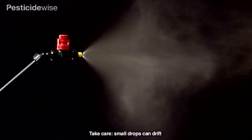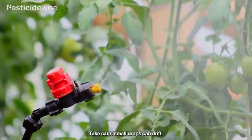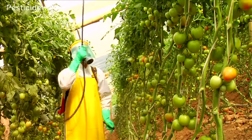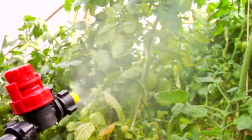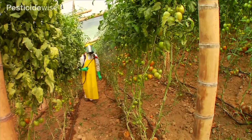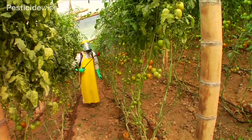The intensity of small, fine-sized drops generated by hollow cone nozzles and the angles of their projection ensure the leaves at the front of the canopy and the concealed leaves within are all sprayed. Monitor your spraying pressure and keep your spraying speed constant. Constantly check that your nozzle is producing the right spray pattern and drop size. Be careful neither to spray the ground nor to spray over the top of the row, as this will waste your pesticide and be a risk to the environment or anyone near you.